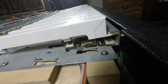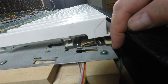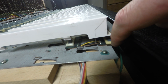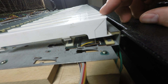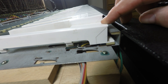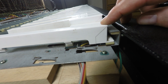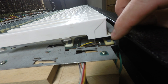You can see the two little sensors — one for the black keys and one for the white keys. These are the actual pressure transducers. The foot of the key hits on that pad; it's kind of a pyramid-shaped pad. The harder you press, the lower its resistance goes. Basically it shifts the voltage from around 0.3 to 0.4 volts with nothing on it to roughly 6.4 volts under full pressure. That's our target that these sensors should be delivering once they're all cleaned.